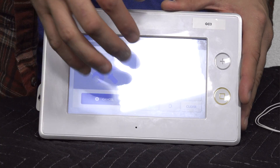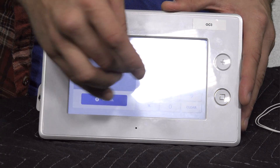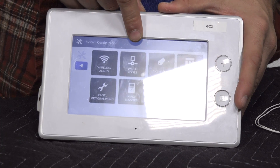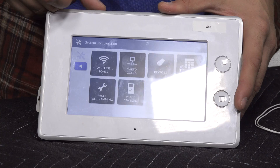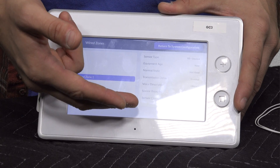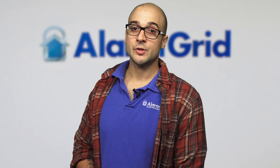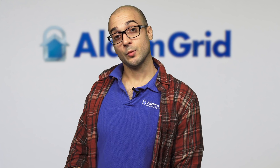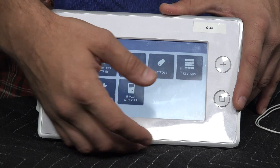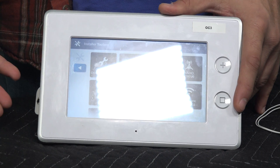In programming, you do have to set this up if you're going to attach them right to the system. If we click on the 2GIG symbol and enter the installer code — ours is the default, 1561 — and then go to System Configuration, there's a menu designated for the wired zones on the system, which makes it really easy to find. Clicking that, you'll notice wired Zone 1 and 2 show up, and all your zone programming is right there. After wiring them up, you just jump into programming, set what the zones will do, add any descriptors, chime noise, and other settings. When done, click Return to System Config, and if you made edits it will ask you to save.